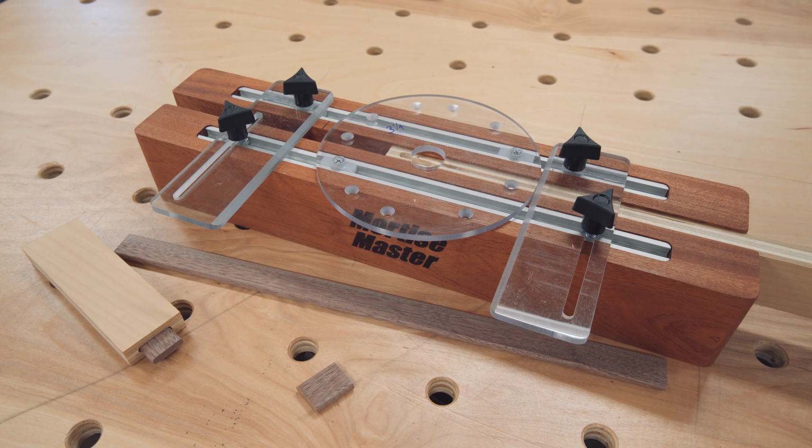So the 1/16 of an inch wiggle room is to allow you to wiggle these back and forth a little bit during assembly. So let's just say that you're off by just a little bit on milling one of these slots. You're off by up to 1/16 of an inch, and you put it together, reference faces, put it together something like this, and it's not lining up, right? Well, if you make your loose tenon stock 1/16 of an inch less, then you have a little bit of wiggle room to slide these where they need to be as you're doing the assembly.